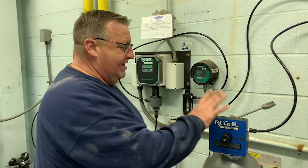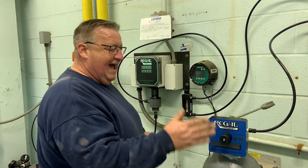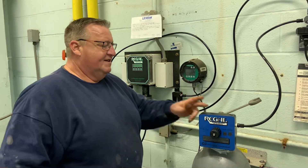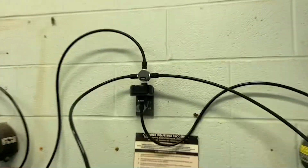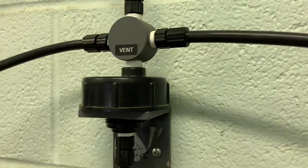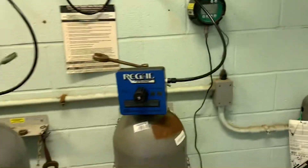When this vacuum regulator goes empty, what's going to happen is the diaphragm comes back, seats up against the back plate, and pulls a high vacuum. Because they're tied together, it automatically pulls — it'll pull this vacuum regulator at continuous speed.